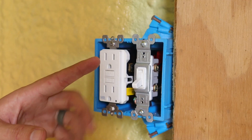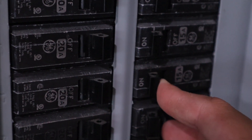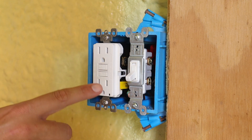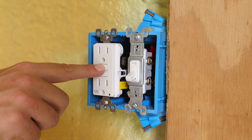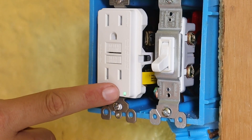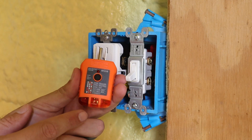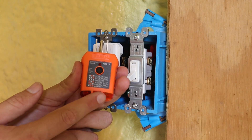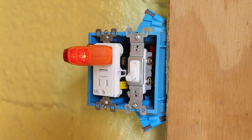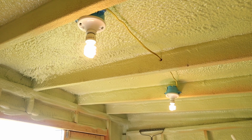Before I cover this up, I like to test everything to make sure it's working so I can get into it easily and fix any issues. Now that power is back on, I'm going to take my outlet tester and make sure everything is wired up correctly. On this GFCI, first I need to push the reset button. There is power flowing into the outlets and there's a green light at the bottom indicating it's working. I insert the outlet tester and the two indicator lights on the side light up — good. Now I check my switch to make sure the lights come on, and sure enough they work as well.